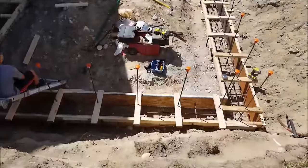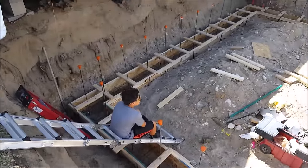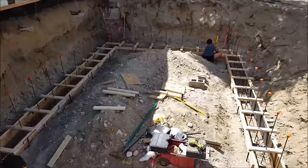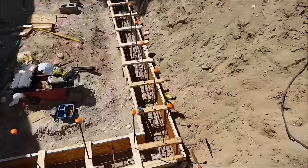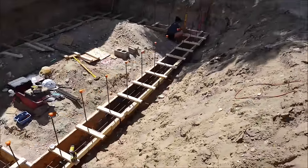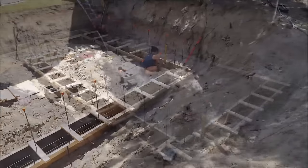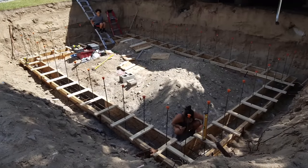Make sure to put safety caps on top of all the vertical rebar pieces. Without a safety cap, if you fall inside the hole onto a piece of rebar it could cause serious injury. There are other methods to tie vertical rebar in place without using 2x4s on top, but for me this seems to be the easiest way and provides the most support.